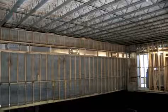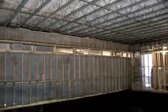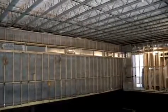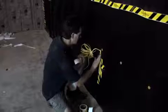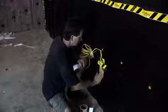In this situation, we have metal ceiling trusses with wooden furring strips. We'll attach the material in the same manner as we did on the side walls. This is where Acoustiblok's unique. If you have a hole or a penetration that you've had made to pull a harness through, it's no problem. Take a scrap piece of Acoustiblok, lay it over the hole that you had to make, tape it on to our material. You will not compromise the STC of the assembly.